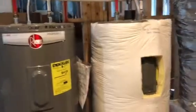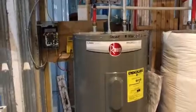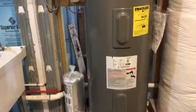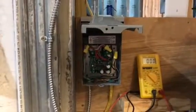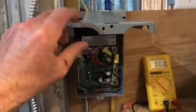So basically this acts as a preheater, making it a little less onerous for both the tank on the right and my pocketbook. On a good day, roughly 3500 watts should come in, which should more or less heat that 300 pounds of water in the tank. This MPPT controller is a pretty neat device — it heats my water and acts as a storage device for electricity, because everybody needs hot water.